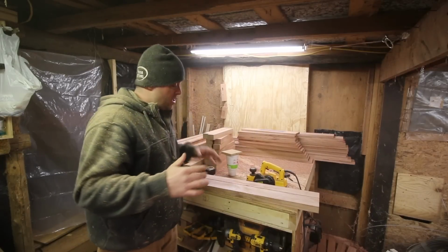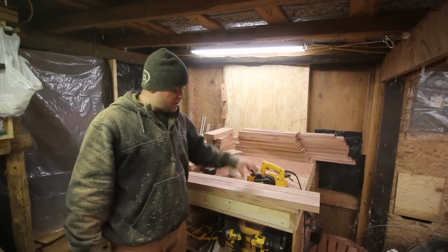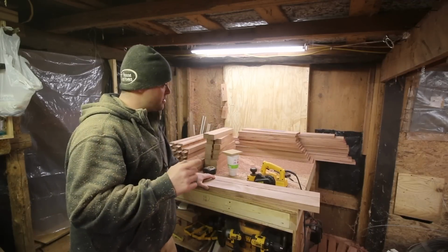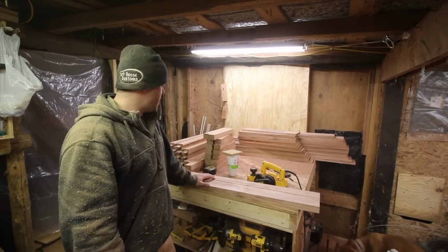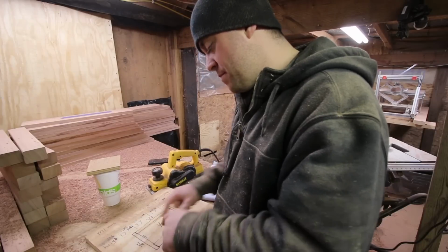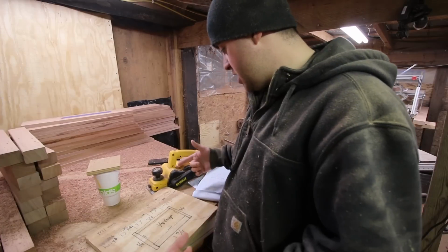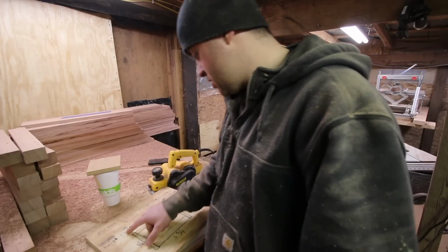So when I built my door, I didn't start this step until after that was all glued up. So what I'm gonna do is cut all my pieces, the sides, the tops, like an inch long, and then I'll mill them down to the correct thickness, and I'll get them real close to what they gotta be, and then I can come back. Once I glue these up, I can cut them to their final dimension. If I cut my bottom sills a 1/4 inch bigger than those original numbers, it'll give me an 1/8 inch reveal around the window. But right now I'm just going to cut them 1 inch and 1/4 bigger than these numbers.